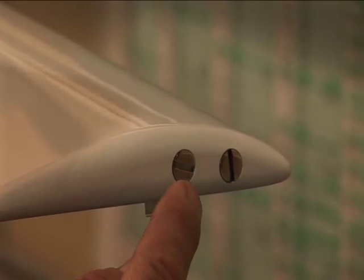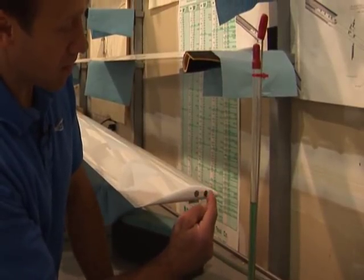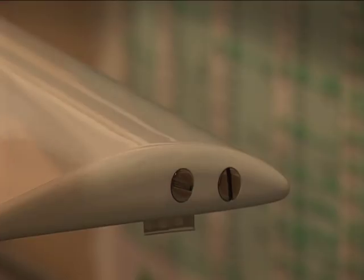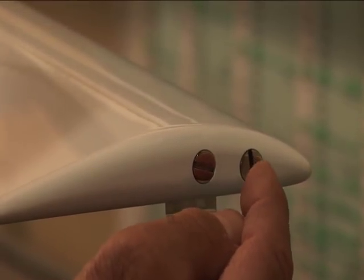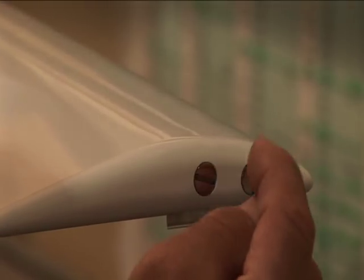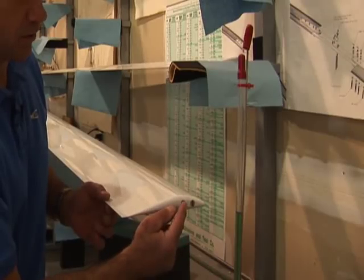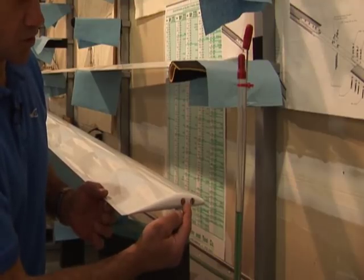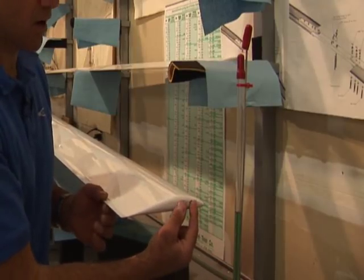Make sure you lock-tight these two screws with blue lock-tight, and don't plug the space around them — just a little bit on the tips of the threads. It's also a breather for the air cavities inside the rotor blades. You can check it by putting your mouth around this, blowing inside, and letting go — you can hear the air pressure blow out, and you know that's proper. Don't use too much lock-tight. Use a driver that fits perfectly; from the factory they are lock-tighted in place.